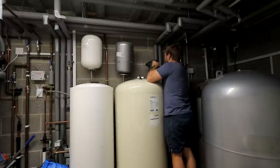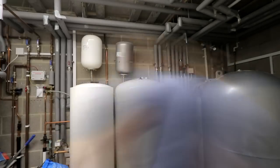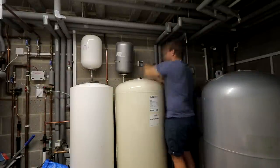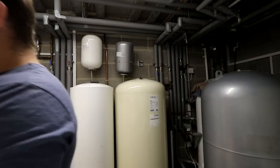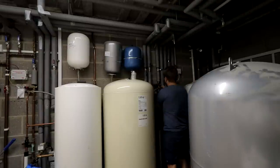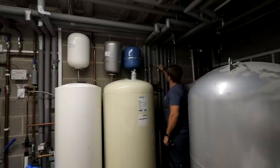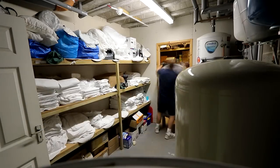The final bit of the job was a naughtiness that wasn't done by the previous plumbers — putting in an expansion vessel. This one is designed to take the expansion of water as it gets heated up. We're going to put it on the system side of the combination valve. It's slightly smaller than what I'd like — I couldn't get a 24 litre expansion vessel — but it's still going to do a really good job and make this fully compliant. So now when someone shuts off the valve to the mains boost, we still have some area of expansion that is compliant.